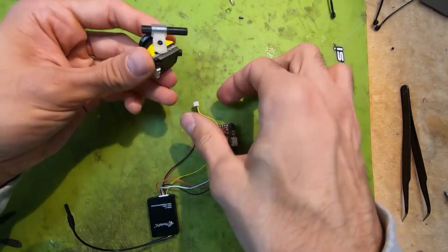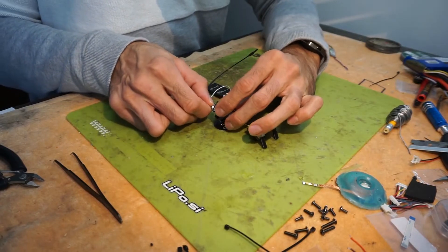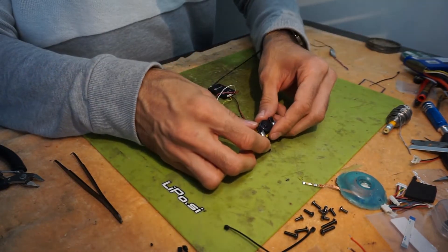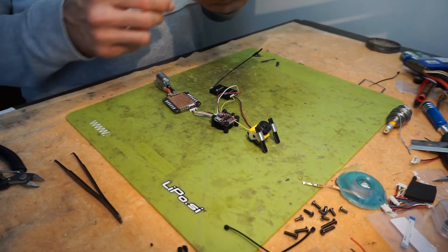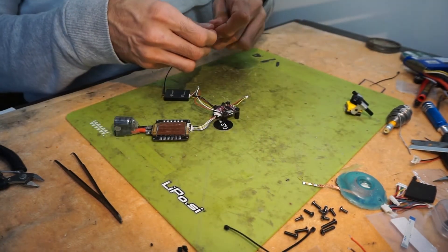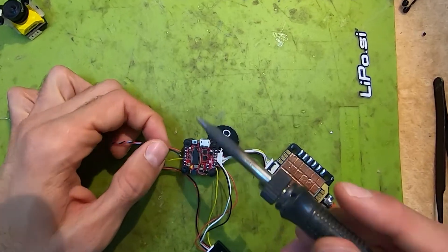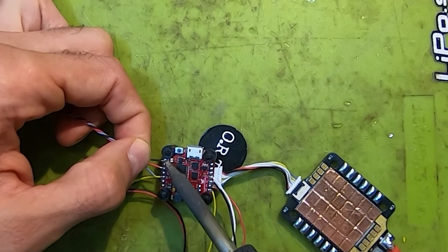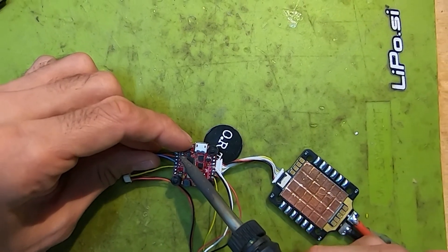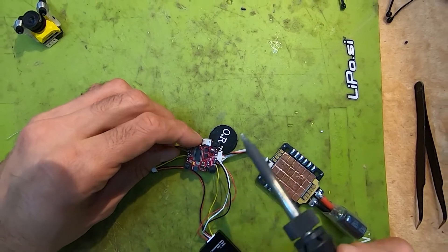You're ready to plug your camera in. When you have your power plugged in you have the whole circuit ready. Next we are going to connect your receiver. In order to do that I'm going to use the RX pads on the top. The first from the right is ground, then it's 5V, and then it's the RX pad.